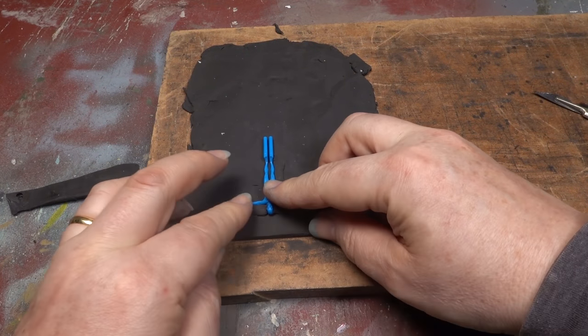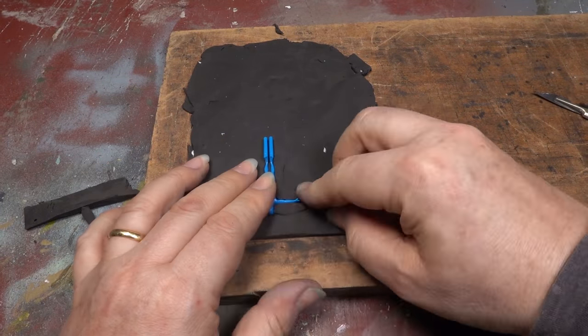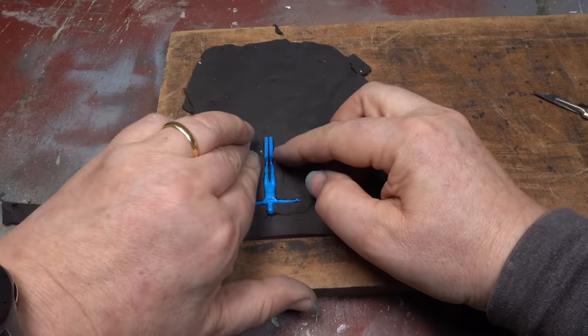This is always easier with soft plasticine. It's worth taking your time with this stage, as keeping the plasticine smooth will dictate the quality of the casting, and make the later stage of cutting the mould much easier.